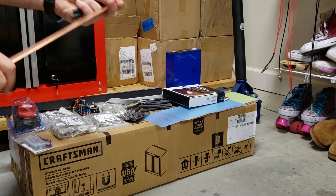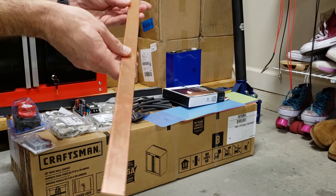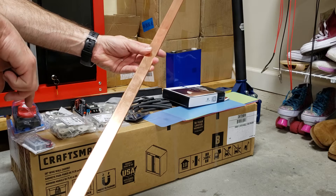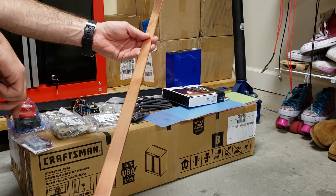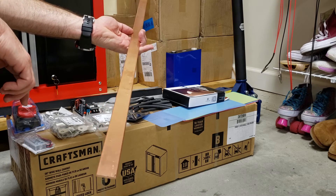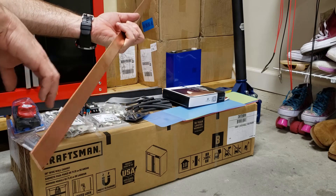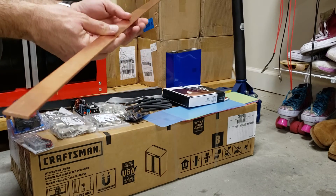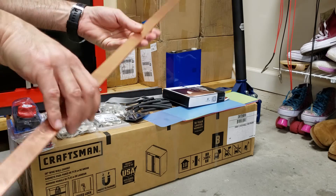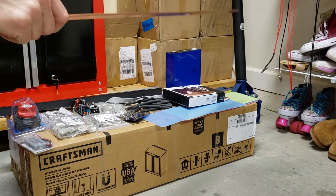Those interconnecting cables go on this copper bus bar. The copper bus bar is one eighth of an inch thick, one inch wide, and I need about 15 feet — this is a leftover from last time. I paid a premium price because this one has rounded edges. I have a lot of wires going around these and I didn't want sharp edges — another layer of protection so the sharp edge doesn't cut any kind of wire.